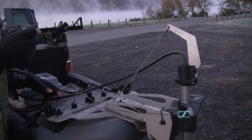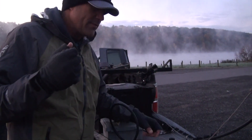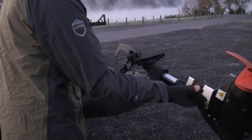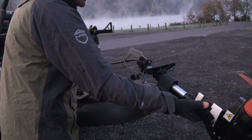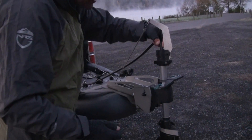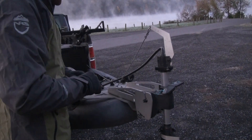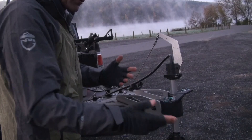A lot of times with years and years of use, people don't really pay attention to it — maybe they even have the motor in the up position and it gets pinched underneath something. They lower it down, they don't even see it happening, and it really pulls on that and it can undo this waterproof connection here at the top. Then it rains or whatever, water gets in, and destroys the motor.